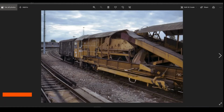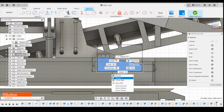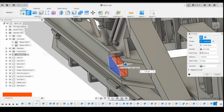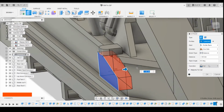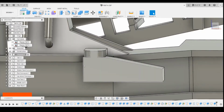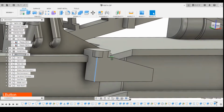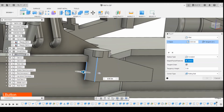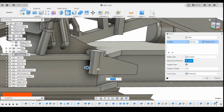Okay, I'm going to extrude this back in. It wants to cut. I'm going to come in a millimetre. I know it wants to be overlapped there, but I'm going for a bit of strength. Click on OK. And what I'm then going to do is, I think this needs to be rounded off on the end here. So I'm going to select that edge and that edge and just fillet those in. So 0.5, so that matches the top there.